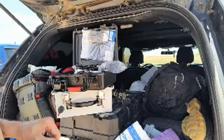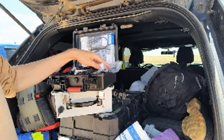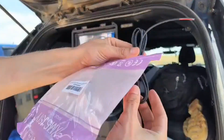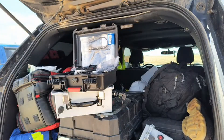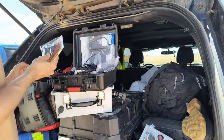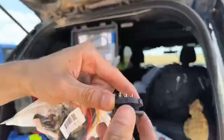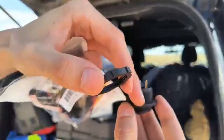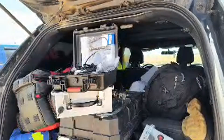I'll keep these strands of wires that I cut off the pigtails because they might be useful if we need to extend the cable. Those are live in the Radar Omega app right now if you want to go take a look. We just use these cheap Chinese USB-C power pigtails so we don't have to make our own — it's way cheaper, way easier. You get like five of these for eight bucks, you can't beat it. These are actually the new switches we have — instead of having to epoxy the switch into the side, these have a thread so you can put a little silicone around it and screw it down. It's a nicer switch, same price.